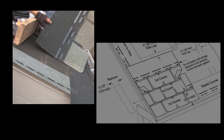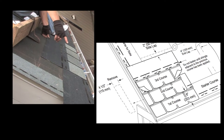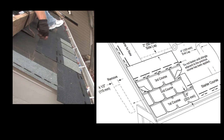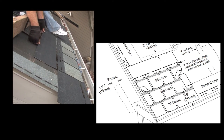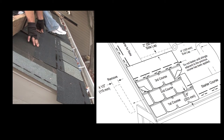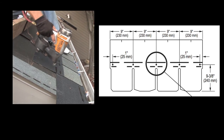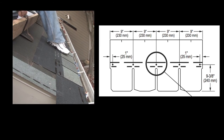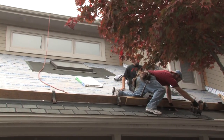If you don't offset the 4½ inches, which is required for laying the shingle, you can see there you'll have an open seam every 3 feet. But by doing your 4½ inch offset and using your rack lines, you hide that seam, which guarantees there's going to be no leakage. 5 nails per shingle, above the drain line, in between the tar strips.